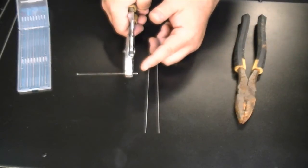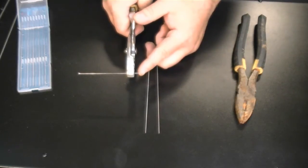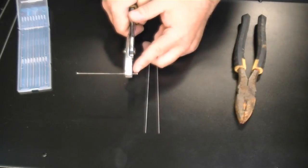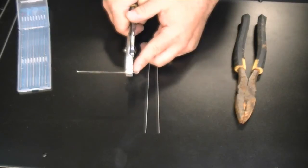You may be asking why not just grind the contaminated tip — that's a good question. You're supposed to be using a dedicated grinding stone whenever you're grinding. One of the things that happens is you put the contamination into the grinding stone and all you end up doing is reloading the tungsten with that contamination over time.